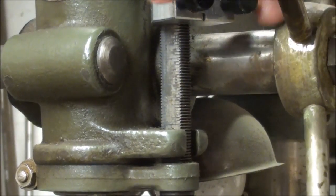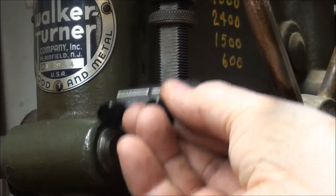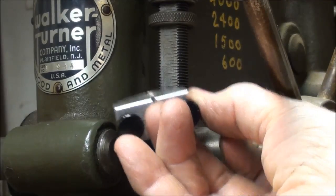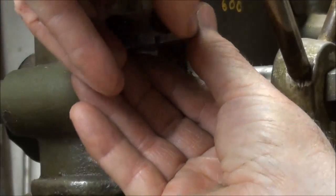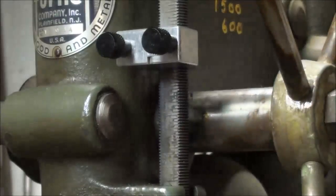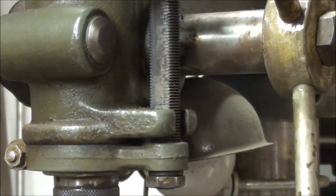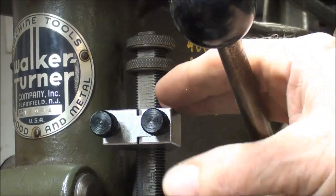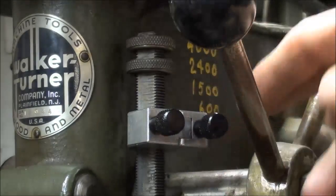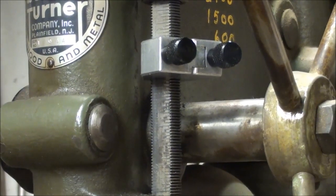This is something I'm really going to use often. So that's a possibility for you for one of your next projects. But make sure that you check on your drill presses that you have clearance here. I noticed on this one I will not be able to mount it straight out with the knurl knob straight out — it has to be cocked just a little bit on this press, because there's a boss here for the quill lock that would interfere. If I put it straight in like that, it's going to hit — there it's hitting — so I need to swing it out. But other than that, that's going to work perfect. I only paid $4.50 for this thing, and that's why I bought two of them. The shipping will kill you, so wait until you have an order and just add that onto the order. I think probably all of the suppliers have these at a cheap price like that. So that's the poor man's depth stop for a drill press.